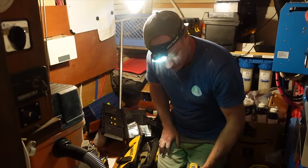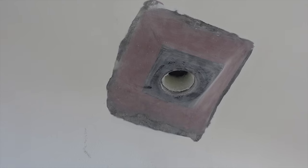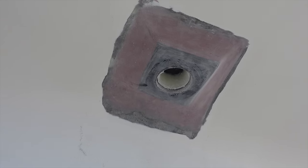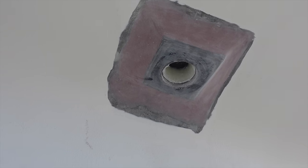Tried drilling up from the bottom but it's actually too thick. I'm just going to drill through here now and that'll be our hole for our sea chest. I've got a backing plate of G10 underneath — a backing plate and a fairing block down the bottom. Let's drill this out.